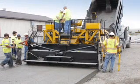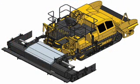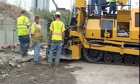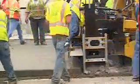The screed is available in a fixed width or with telescoping capabilities. A typical asphalt paver screed is not generally used in the RCC application because of the high initial density requirement. Grade or elevation for the Gameco RCC screed can be controlled through the tow point hinge cylinders in several ways.